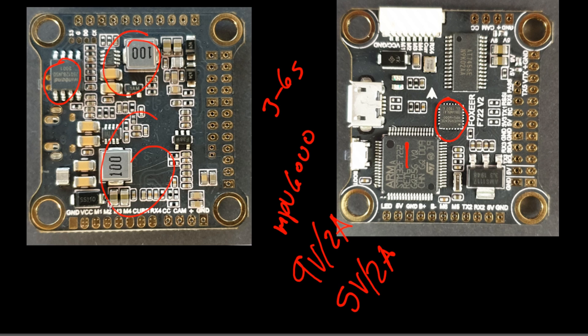We also have memory on board. Looking closely, we see two diodes — I'm fairly certain these are TVS diodes, transient voltage suppression diodes, which limit high-voltage spikes into the system. It's kind of like a low-ESR capacitor that cuts off voltage spikes, which is really important since this is where all your sensitive components are: the MPU6000, the OSD, the flight controller. There's one on the top and one on the bottom side. The other appears to be a normal diode near the VCC and ground — where you connect your ESC — so if you accidentally reverse polarity, you have a high probability of not burning the flight controller.